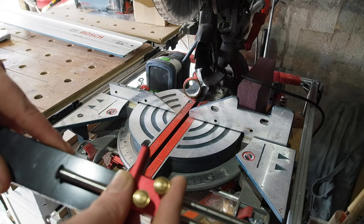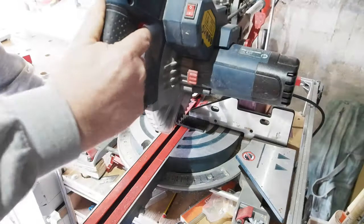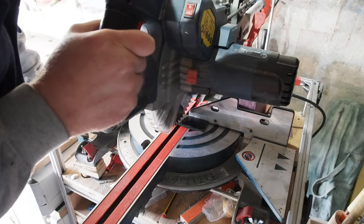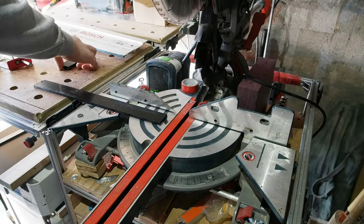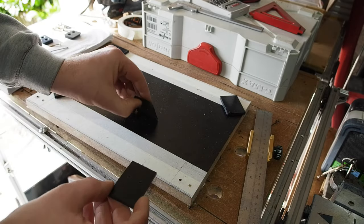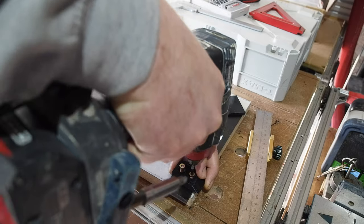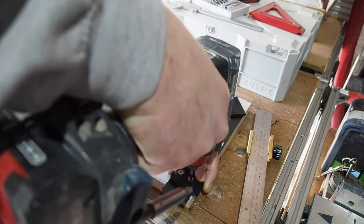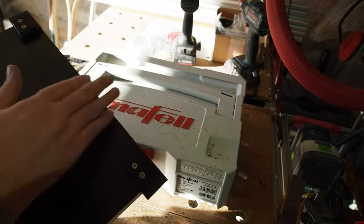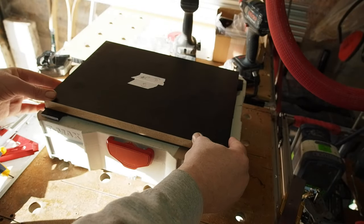To mark this stuff, a simple marking gauge works great to score a line. With four little pieces cut, I pre-drilled everything to minimize pieces flailing about when they're fixed in place. I'll give each corner a pre-fit too to make sure everything is good. With the feet in place, I can try it out on a box — and thankfully it seats in place just fine.